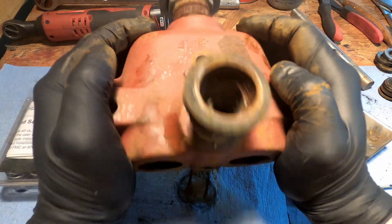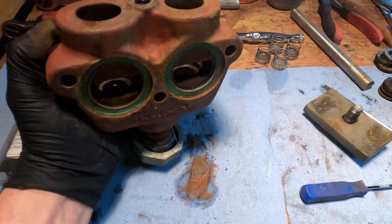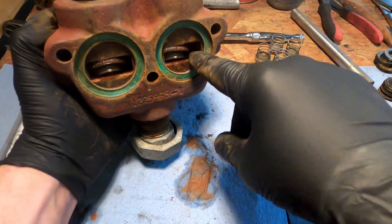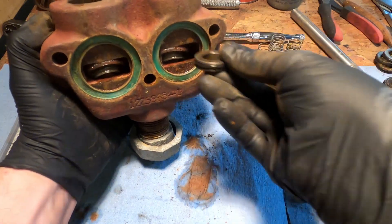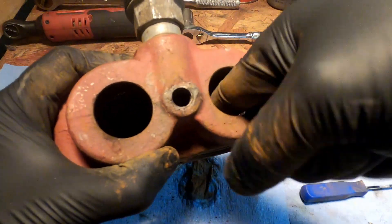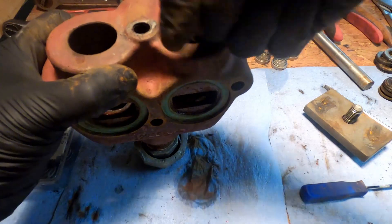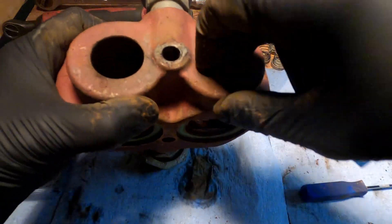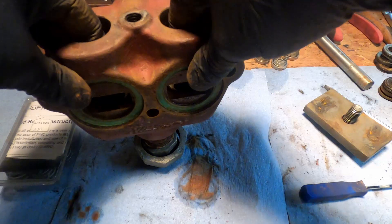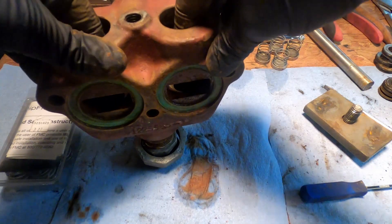That's that fully taken apart. Now the important thing with these heads is right back in here where these sit is a machined surface — the cylinder it sits in and then this flat surface down here. And then the outside valve sits in a cylinder right there. You want to check those and make sure you've still got machined surface left, because as time goes by, whatever you're putting through the pump is going to eat on this and slowly wear it away, and you'll eventually start getting blow-by and then you won't be able to build pressure.